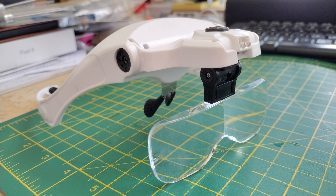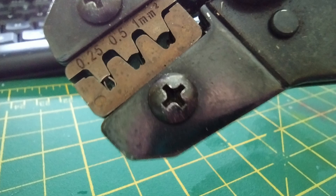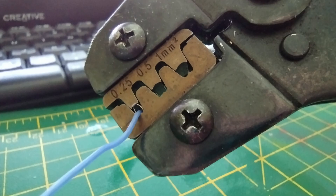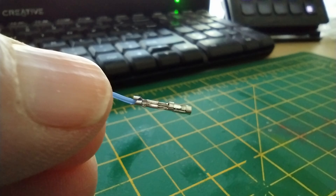They come in a variety of powers. This is one of those Dupont connectors — if I place it in the crimp, you see it's 0.25 millimeter, and to stop it falling out I click it down just a little bit. Then prepare your wire — for these thin ones I like to strip a bit more than normal and fold it over. Then you put it into the clamp, clamp it down with your hand and you get this result. On the very thin wire the cable clamp at the back doesn't really bite in very well, so I tend to use a pair of flat needle nose pliers just to cinch that up.